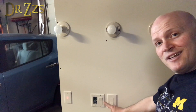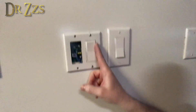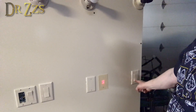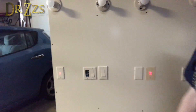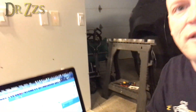Now this one here is the three-way switch — we left this open so you could see the Sonoff. These are just regular three-way switches. This one is connected with this one over here. So when we turn one of these on, the light comes on. I can turn this one off and the light goes off. I can also get in Home Assistant and hit the three-way button and the light goes on. That's one Sonoff with GPIO 14 connected to the common pole of the three-way switch, and the connection between those two three-way switches — I didn't touch. That's pretty cool, right?